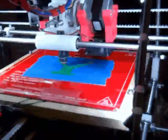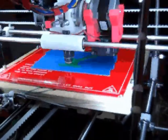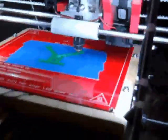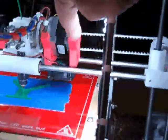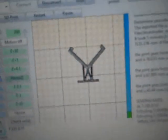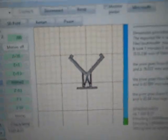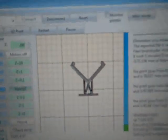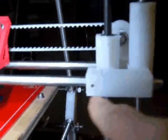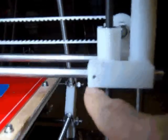I haven't really done much in the last week other than finishing this program. I did change the length of the arms that will go across from here and hook on the outside of the motor. The fan is only going to be mounted with two screws in the bottom. I made the base wide enough to put nuts on top and screw heads in from the bottom or vice versa. I also extended it low enough to go below this X-end idler end.